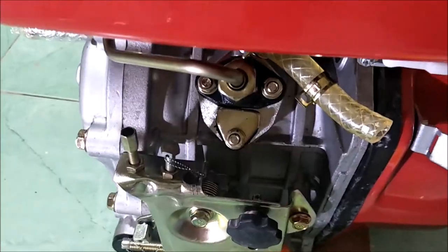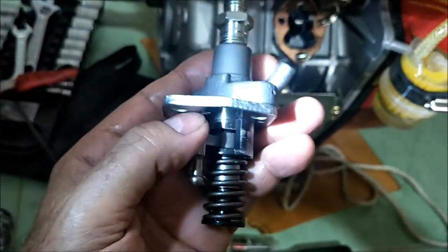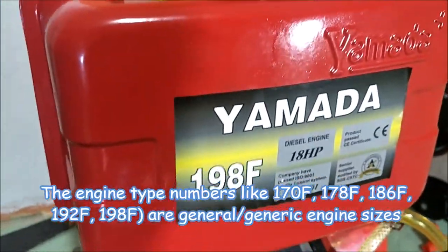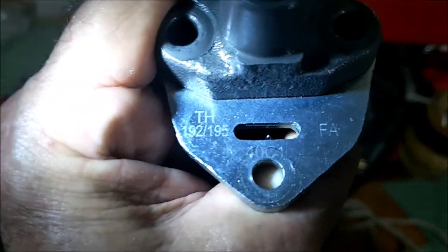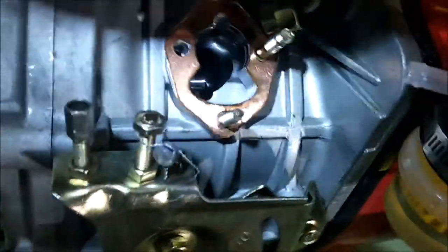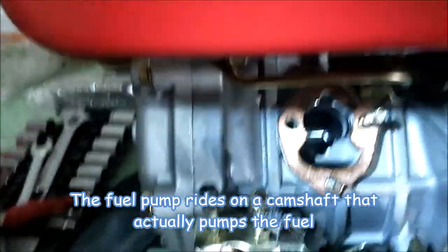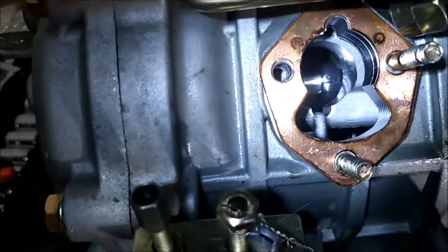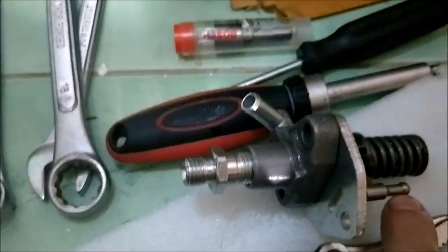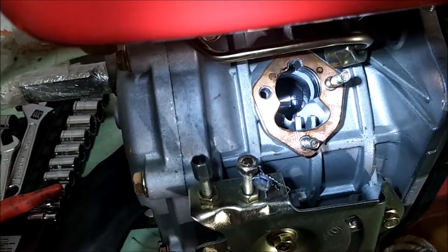Over here we actually have the fuel pump out. The fuel pump is a simple little thing like that. This one is gray; the correct one is probably black. This one here is for a 192 or 195 engine — this is a 198F, so beware. The fuel pump slides into here, and this little metering arm goes between the forks. Look in that hole — as I move the throttle up and down, you can see that little fork go back and forth. The fork slides onto the metering arm. Throttle up goes faster, throttle down goes slower.